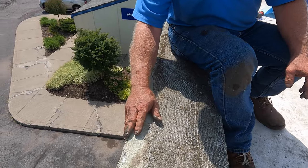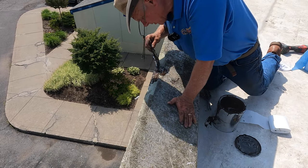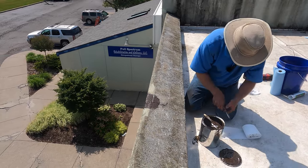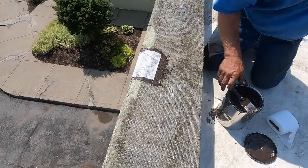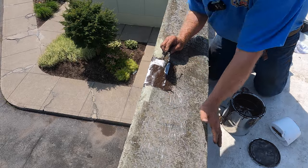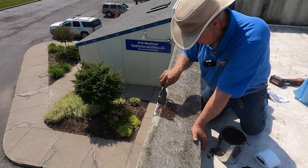This is something you definitely have to take care of. I'm going to do about six inches here — there's going to be a front — probably go an inch down on the other side and then do this. Look at that — that transition will save that whole stucco. This is super, super important. If you don't do this you're going to destroy the whole wall. I've seen this happen. Use Turbo Poly Seal and do a transition halfway over the wall.